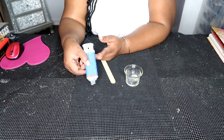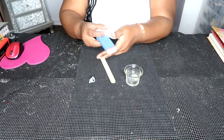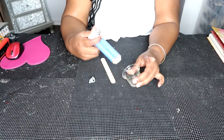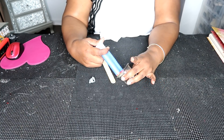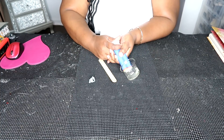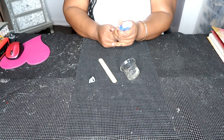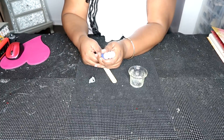To use this, you're going to take off the top and place your epoxy by squeezing equal parts. The reason why I like this is because you do not have to pour and measure equal parts yourself — you simply squeeze by depressing the plunger and equal parts of epoxy come out into your container.